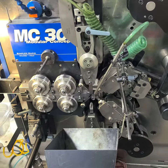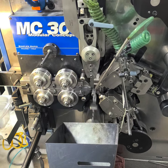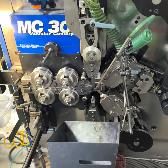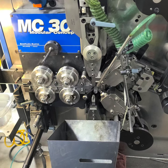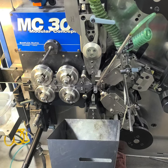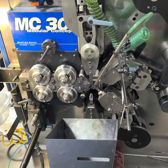Part of this arrangement is the use of sorting chutes on our Cyclex rapid coilers. Every spring we coil is made to a free length tolerance. Even if the free length is a reference on the print, we use the free length to control the spring forces.